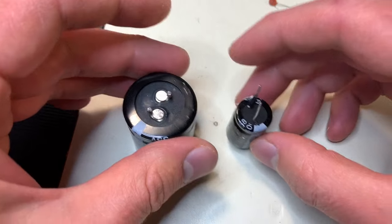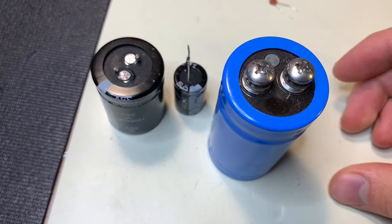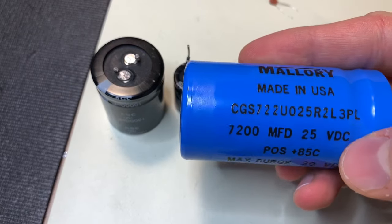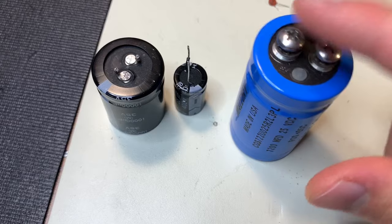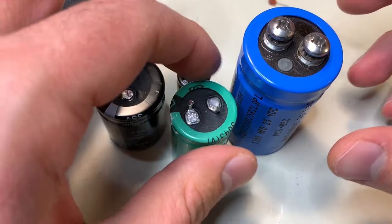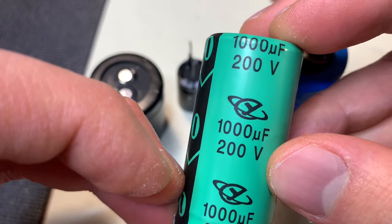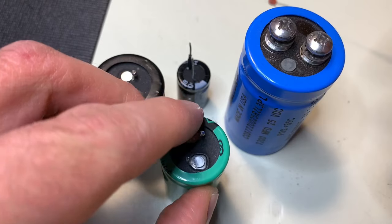Probably wouldn't be a serious shock, but it wouldn't be pleasant. And it can get even more deceiving — if I bring this one in, you might be thinking this one obviously looks dangerous, but this is actually rated for just 25 volts. So if this was fully charged and you touched these terminals you wouldn't even feel it. This one on the other hand, even though it's physically smaller, is more dangerous in the sense that it's rated for 200 volts at 1,000 microfarad. So this one could give you a pretty substantial shock if it's fully charged.